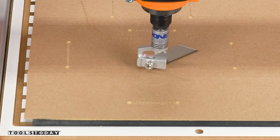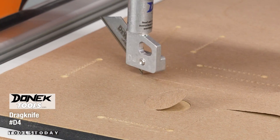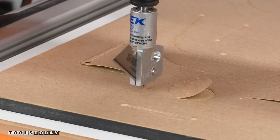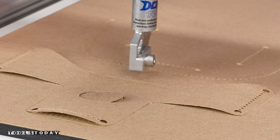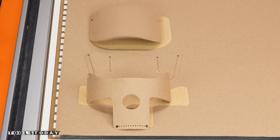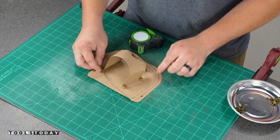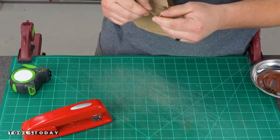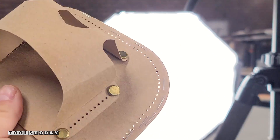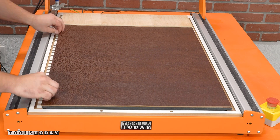With a drag knife, the spindle is off while cutting. There's a bearing on top that allows it to freely spin, and with the knife being off center, it simply follows the machine as it moves around. With this test I'm also seeing if my idea of how to set my X and Y zero position using an off-center tool will work out. I can attach the tape holder and make sure the rivets are going to line up, and get the pocket assembled. My stitching holes all line up even with the angle cut, and created the gap between the two pieces I wanted, so we can move onto the leather with confidence.